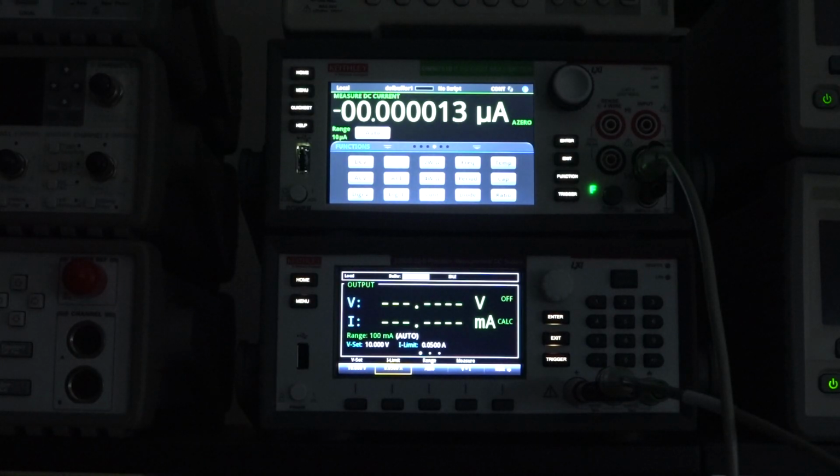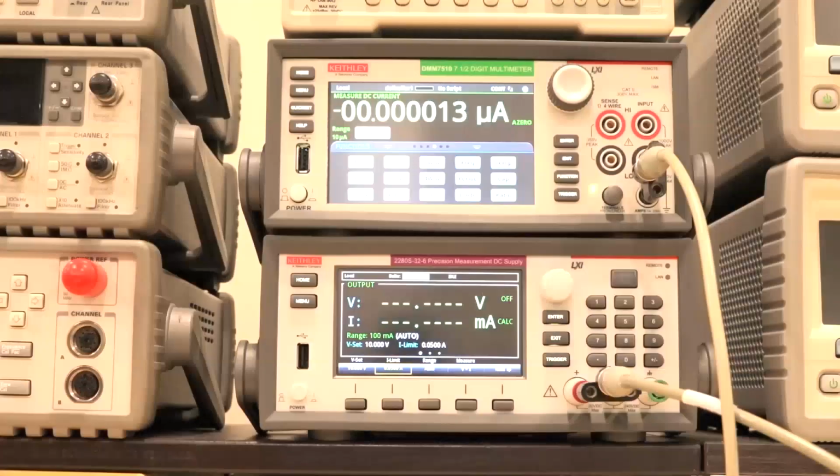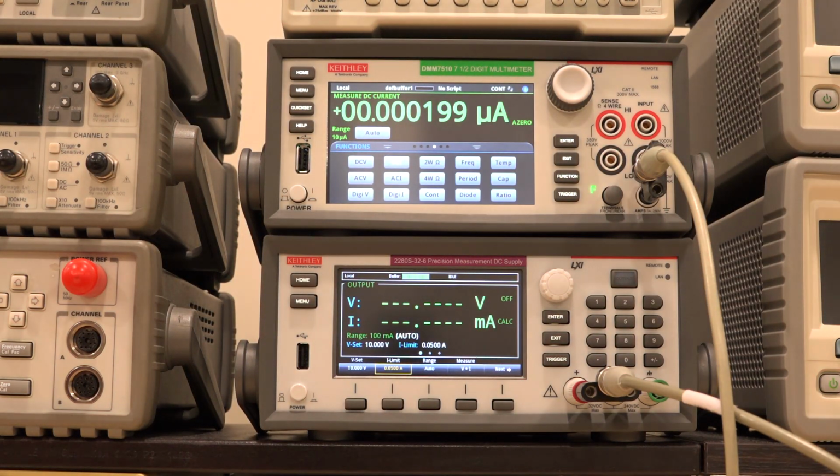The reason there is still some current is because there is stray light in the lab. My monitor is on, and some work light is on. So there's still some light coming to the LED. And if I put my hand around the LED, I'm not really able to block it any more than I'm blocking it now. So having said that, I can turn the lights back on again. That's going to be a stray measurement, which is not good.